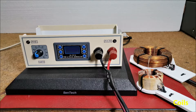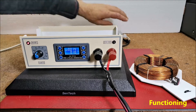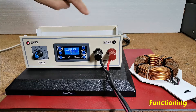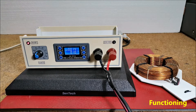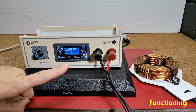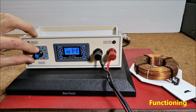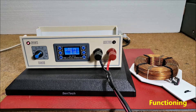Now let's see how the device works in reality. When the device is switched on, the pulse LED starts flashing at a frequency set by the signal generator. Based on the instructions of many manufacturers of such devices, this frequency should be in the range of 4 to 30 Hz and duty cycle with a value of 5% to 15%. The potentiometer controls the intensity of the magnetic flux, and its indication is proportional to the intensity of the LED.